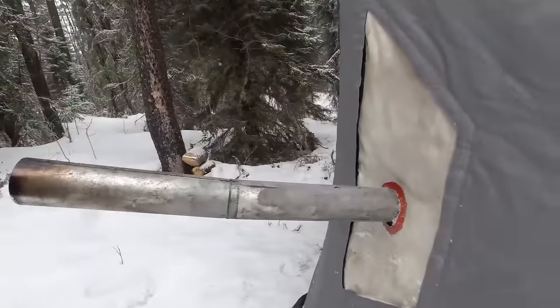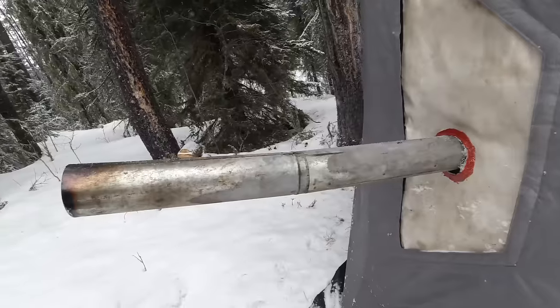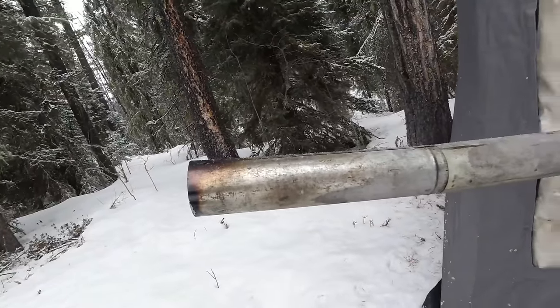So let's take a look at the stovepipe. You can see it's pretty horizontal. And I've screwed it together like I normally do. I always say, it's a point of safety, screw the stovepipe together, because if one of those sections comes apart while you're asleep, it's not going to end well. You're either going to be smoked out or worse. So for the sake of just a couple of screws, it's worth it.